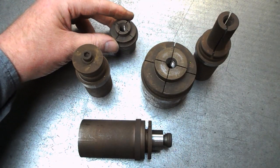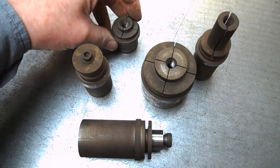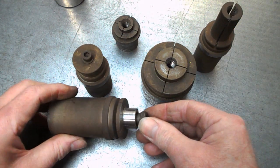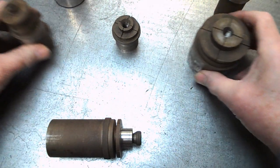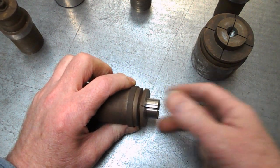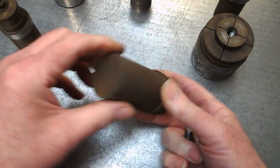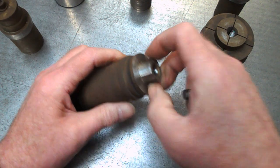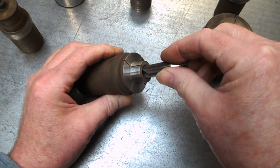I thought we'd take a look at some of these old mandrels that came with the lathe that I bought about 20 years ago - they'd just been sat in a box on a shelf all that time. Sooner or later you'll find a use for these things, and this is the one I was just using. If I take a closer look at how these are made, they're dead simple things - just turned down from some random old offcut of metal. It's got a saw cut left on the end, doesn't matter. Turned down to fit in the chuck, with this end obviously turned down to take your piece. The hole, I think, has been done just with the centre drill.